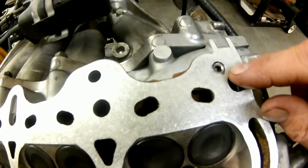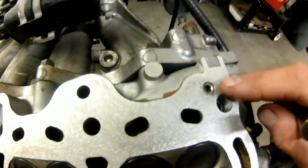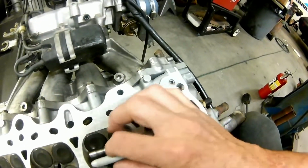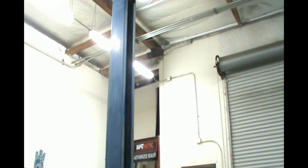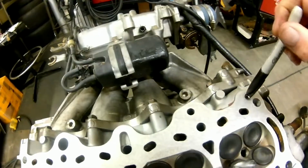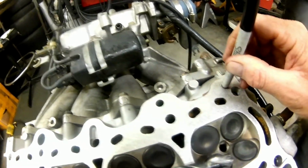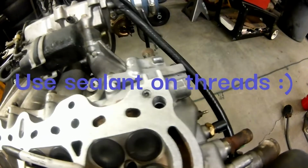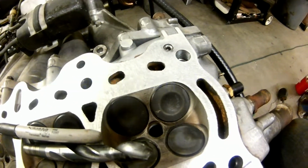Anyway, we also did the pipe plug and tapped. I believe it was with a Q bit, which was in between a couple drill bits, bigger than a 5/16, smaller than a 3/8. Something like that. Anyway, I'll find it in the video and post it. That's the drill bit that you're going to need to drill down until it just hits the bottom. It's just going to go down until it stops, and then you just stop. So you drill it down, it stops, you pull it out, and then you tap it with the 1/8" plug tap. Anyway, looks pretty good.